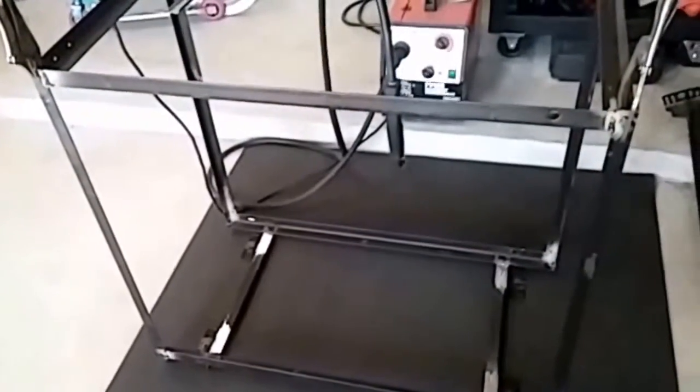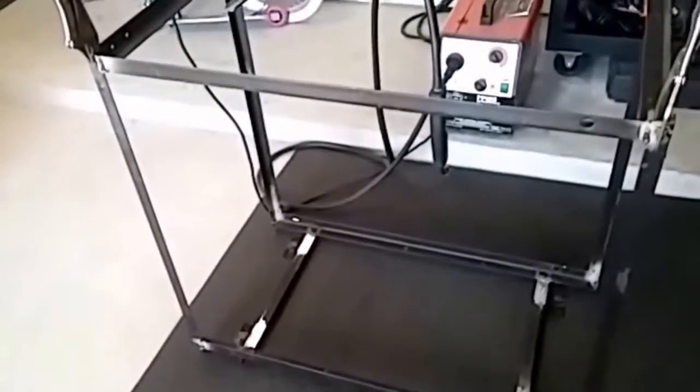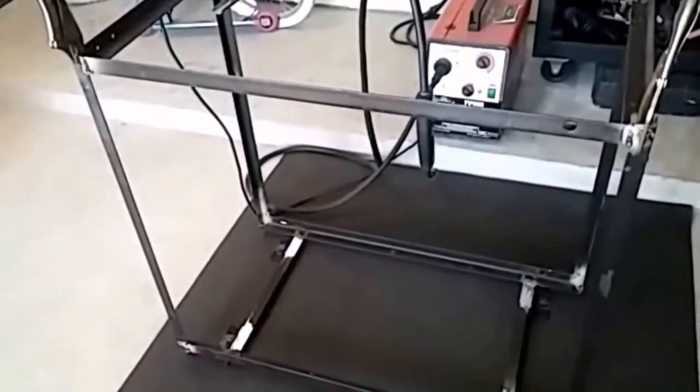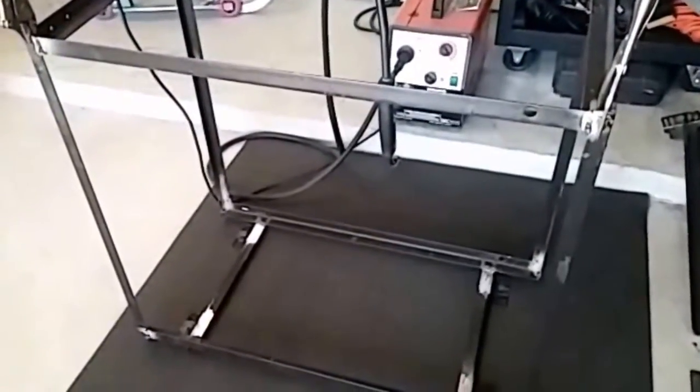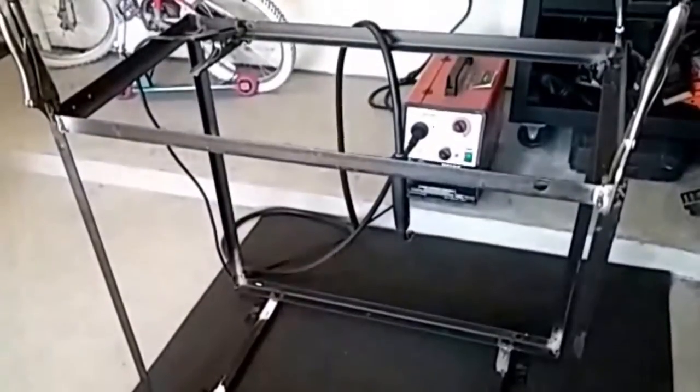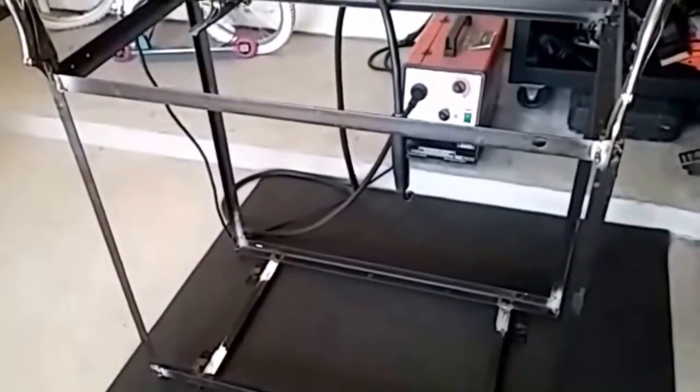As you can see, we've gotten our bottom and our legs put on. Those legs are 21 inches tall from the bottom — that doesn't include the room for the casters. We've got our top tack welded on now and we're going at our middle shelf.